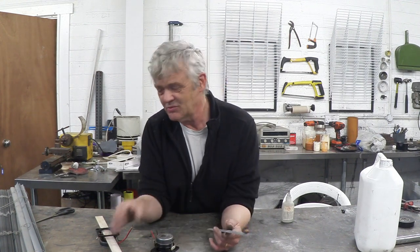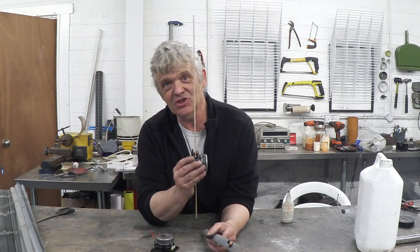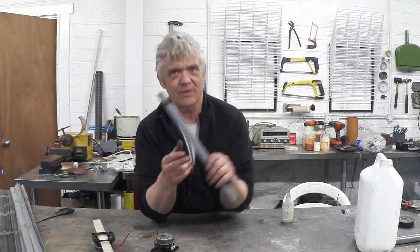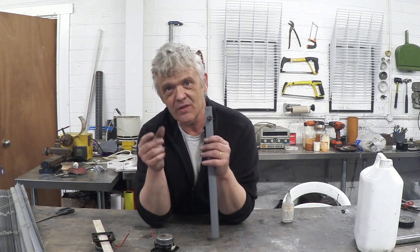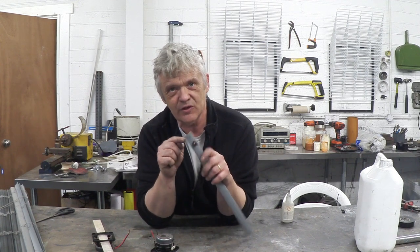These are just random choices I've made — clearly resonance is one of the things you're interested in, so the length of reed is going to have an effect, as is the material. Here we used a bit of wood that's quite long — I imagine we could make it much shorter, and a taper might help to get that vibration going. What we're using here is the inertial difference between the mass of the reed and the mass of the inductor, creating that bounce in the rubber — which is where the fixed magnetic field moves nearer and further away, creating a varying magnetic field.